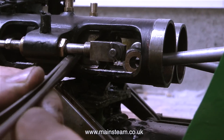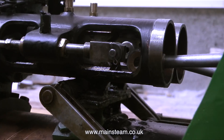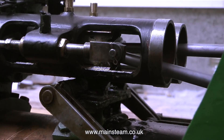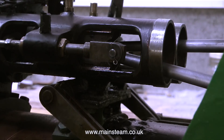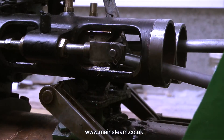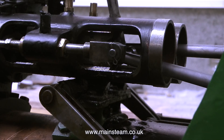In this part of the video I'm going to show you how I fitted the connecting rods to the crossheads. Unfortunately the valve fork is in the way on this shot, but if you look beyond the valve fork you can see what's happening. I'm fitting both of the gudgeon pins through the crossheads, through the connecting rods, and out the other side. It's not simple in the slightest, because fitted to the end of each of the gudgeon pins is an oil box. Once the oil boxes have been fitted to the gudgeon pins you'll see what they're all about.